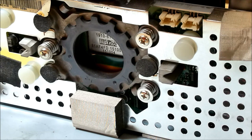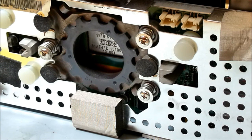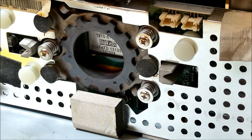To adjust the focus on this, access the test menu with mute 182 while the power is off, then turn the power on. So with the set off, press mute 182 power. Go to the DDP option and select test pattern. And you can bring up a fine crosshatch pattern with little crosshatches about a half inch square each.